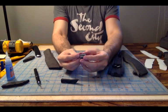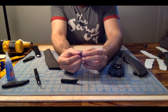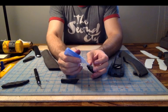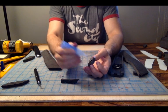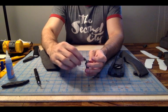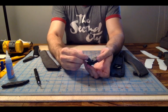So just pull it up about, right about an eighth of an inch up. This little raised area there. Hit the glue on the little edge there, this edge here, and on the back, so you can save the top detail. Just smooth it on in. Make sure you get it inside the grooves.